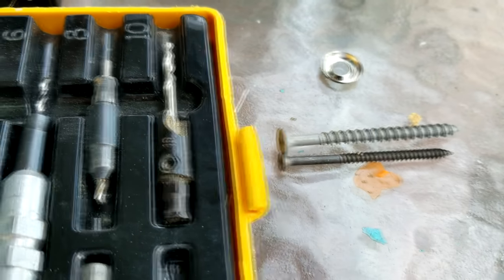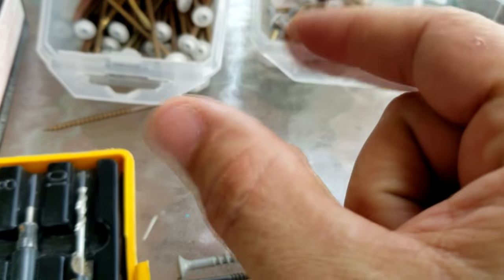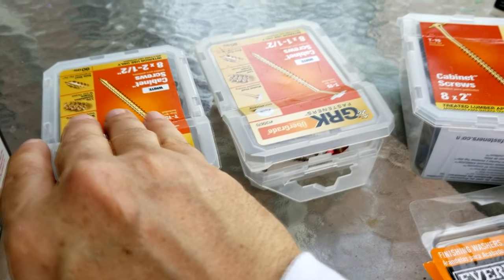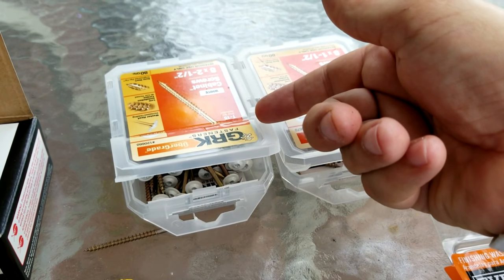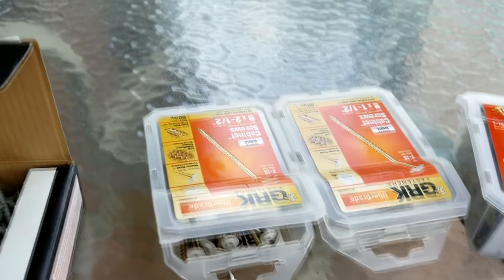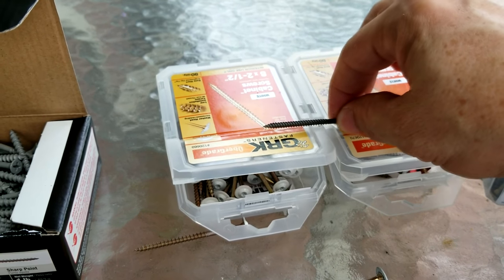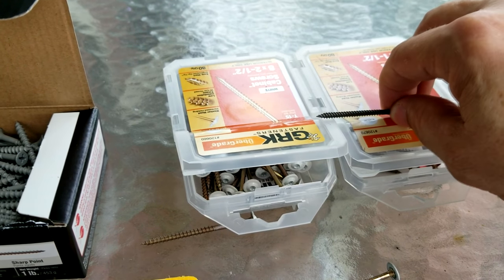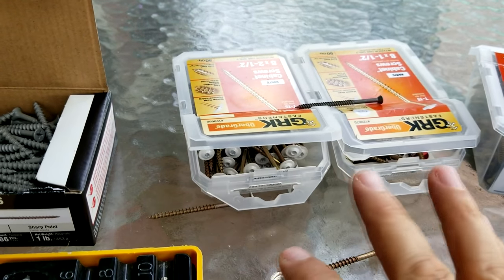That's why it's important to drill that pilot hole when putting two cabinets side by side. Let's say this is one cabinet and this is the other — you drill a pilot hole all the way through the first one and just barely touch the second one with it, and let the screw come in and grab all of the meat. You just need to get things started; that's what keeps it from splitting.